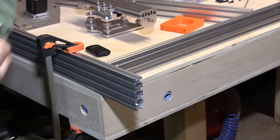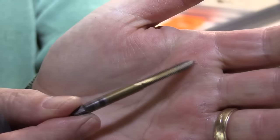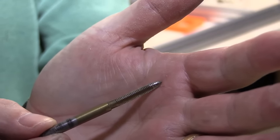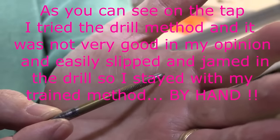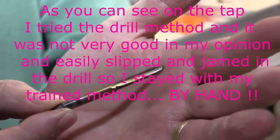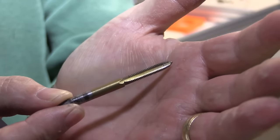There are two main things for tapping. The actual tap itself — this is an M5 by 0.8. The 0.8 is the thread pitch and the M5 is the basic diameter. What you need for this is a 4.2 millimeter hole for tapping into. The clearance where you want to have a screw go right through is typically quoted as 5.5 millimeters or thereabouts — but that gives you a slightly sloppy fit.